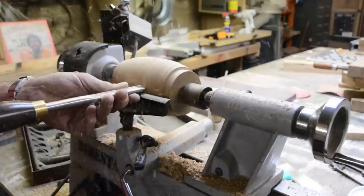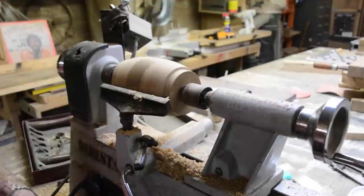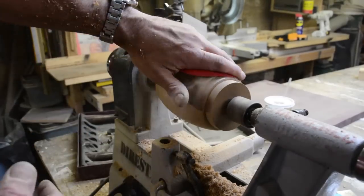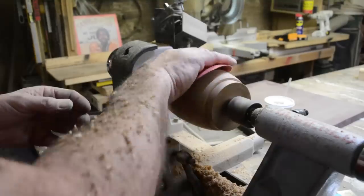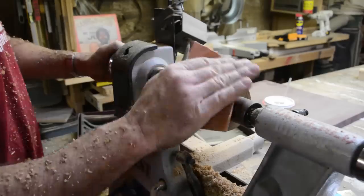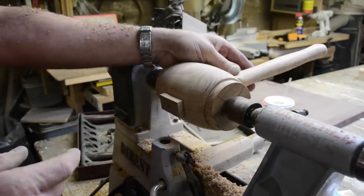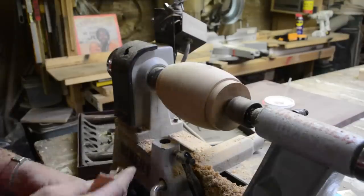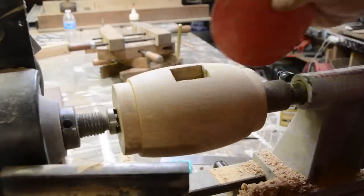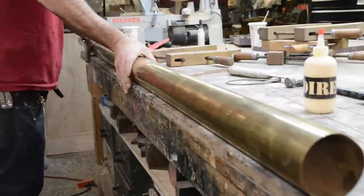Just working it and marking it, trying all different tools. I never know exactly which is the right tool for the job unless of course it's square. You rough it out with little sharp chisels and then clean it up with the bigger ones, and then sandpaper always helps. No matter how fine a grit you use, you always end up with swirl marks, so you always have to go back in. I do a test fit - it looks good. Then I take it out and just sand it, getting all the spin marks out by going parallel to the grain.